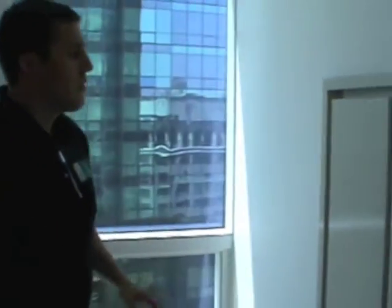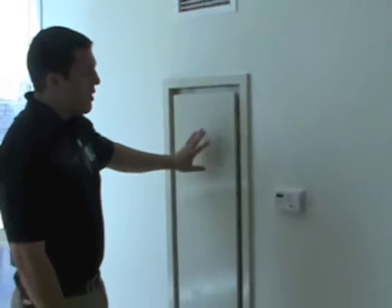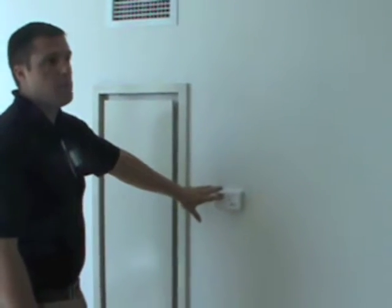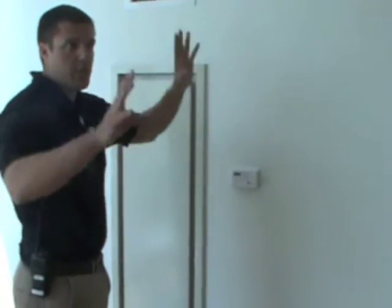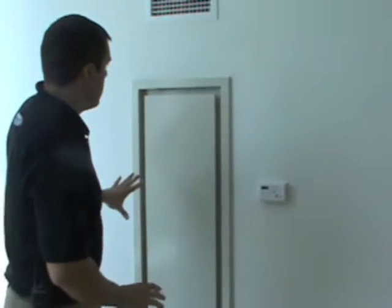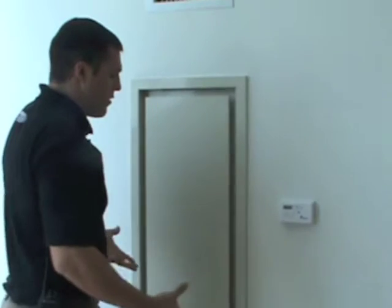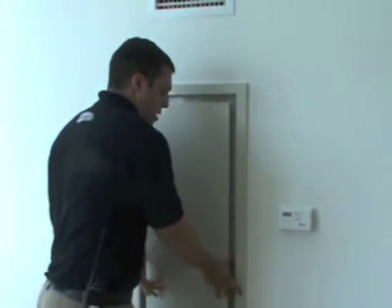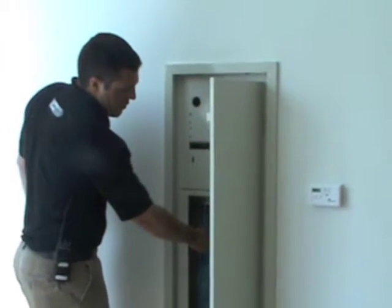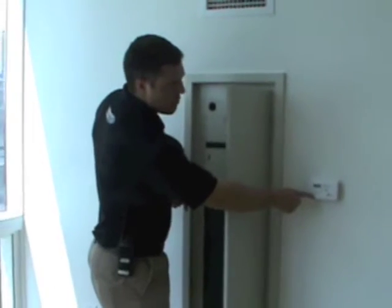Heating and air conditioning. This is your heating and air conditioning unit. It's basically run off of this thermostat, which is located right here. This thermostat is controlling the heating and air conditioning for your entire home. The way it works is this bottom panel is your return — the air is being sucked in through here, going through the filter, converting it into hot or cold air depending on what you have set on your thermostat, and blowing the hot or cold air out the top. It's just recirculating.